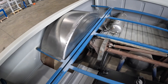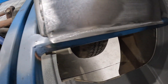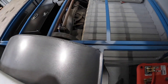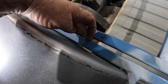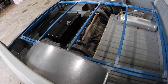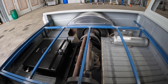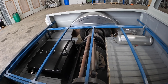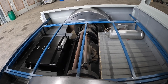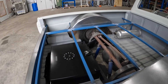There we have it — we've got both tubs fitted now and they fit really nicely. You can see that last little flange I was bending on the pan brake — that sits on the cross member front and back, and I'll spot weld it on there. The front section goes down past this square bar, taken from the inside all the way along, so they'll be fixed really securely. That should work really well. Anyway, that about wraps up this episode — thanks for watching. I'm just learning as I go; I haven't made my own inner tubs before — I've always bought some, cut them up, and modified them to suit, but I've never built any from scratch. Hopefully you can see it's not that difficult — you just need a little bit of patience and a couple of the right tools. Thanks for watching and we'll see you in the next video, cheers.